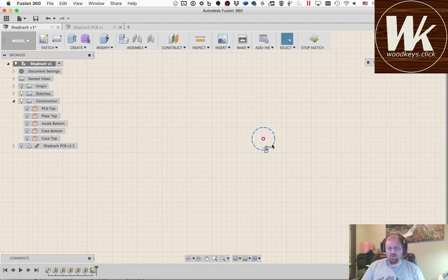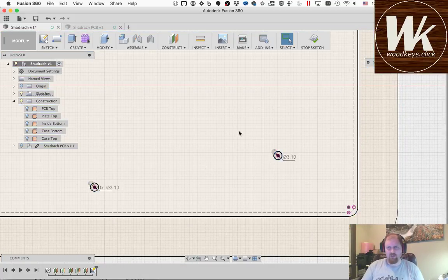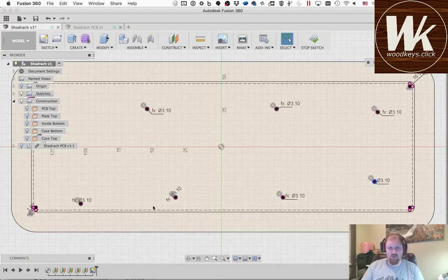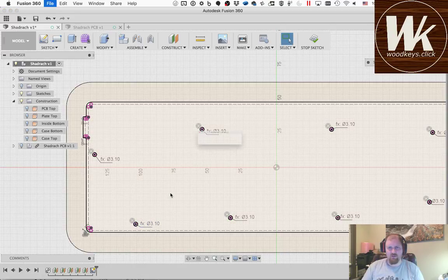These parameters that I'm doing here, this is one of the things that differentiates Fusion from some other modeling programs, because Fusion is parametric modeling, so that means that everything is parameterized. You need to have everything have a dimension in order for it to be well defined. And so each of those parameters is configurable, and you can go back and change those parameters to change the way your object is defined. Whereas some other programs, you're building things up from curves and different things.